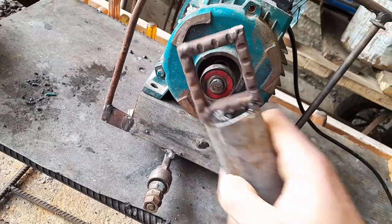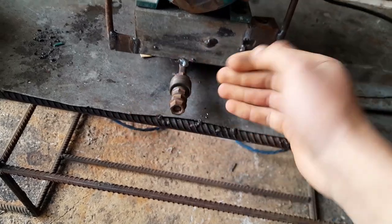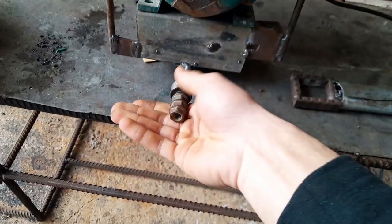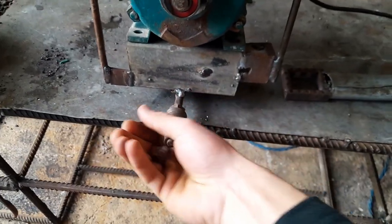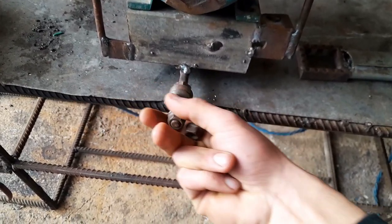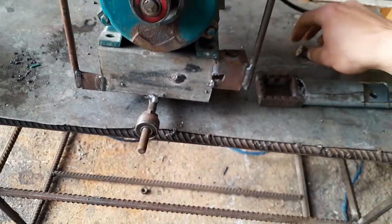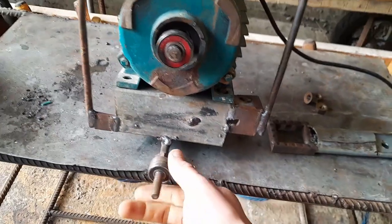This motor doesn't have much torque because it was designed to pump water. We've added weld on the main shaft of the electric motor to gain thickness, and then ground it down from one side so it developed an offset for our bearing. So when the motor turns, the bearing revolves around the shaft eccentrically.